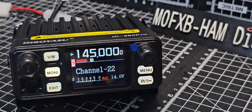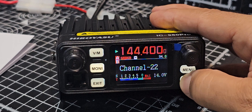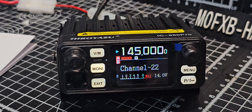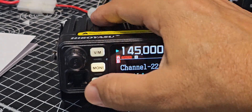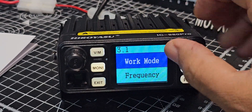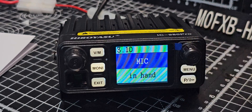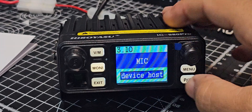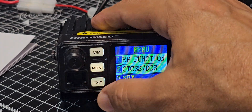You can actually disconnect and take off the mic and just transmit — hello, M0FXB. Of course you need to get right up close to it and select the internal microphone, which is in your settings. Go to menu, number three, turn the knob until you get to mic in — hand is the external microphone. Then if you select, turn — device host is actually the built-in device microphone — and we will be testing it. Bye for now, 73.